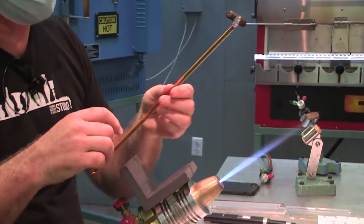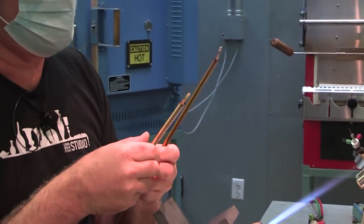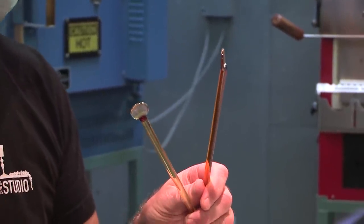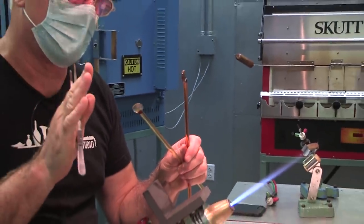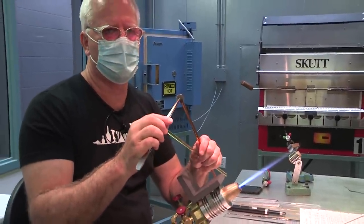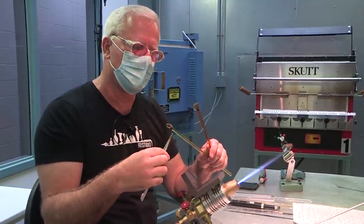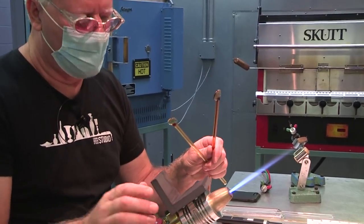Now, the interesting thing that's happening already in both of these is that the ambient heat from heating them is already starting the change. And we talked about that color spectrum where clear is the one end, but then yellow, orange, reds. In this area, you're starting to see, and when we combine yellow, orange, and red together with red purple, we get amber, and that's exactly the point. And that's because of the residual or ambient heat that was left in the glass as it's cooling, and it occurs in both of those. So we're on our way.